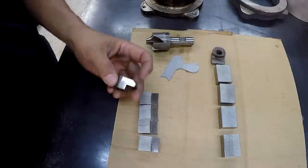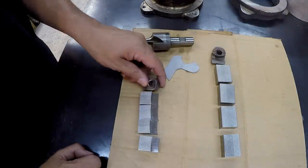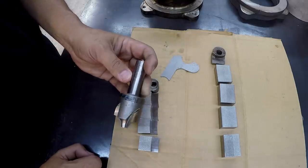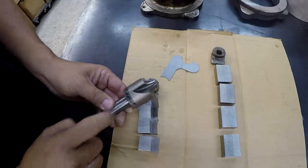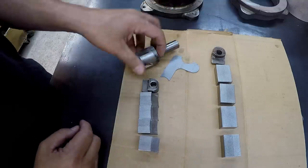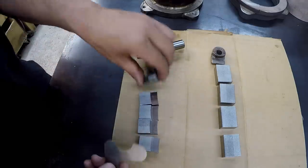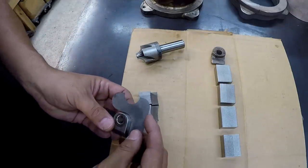I believe the next phase we're going to go ahead and work on now is these two corner radius cuts there. So what we'll do is use a corner rounding end mill. We'll use this guy right there. And this one right there, I believe this was given to me by Eric Hoffmeyer. I believe I wrote his name on that back whenever he gave that to me. So this is a half inch radius. So if you look at my radius gauge right here, this is one of my Lufkin radius gauges.